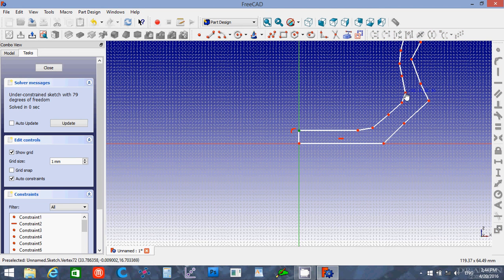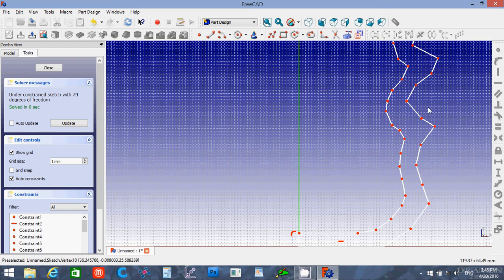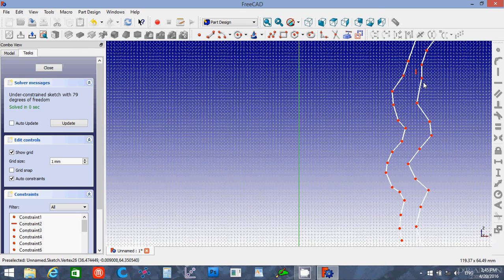Not all 3D printing filament is very good at actually keeping water inside. It depends on what type of filament you're using, what settings you have, and I would use the lowest print setting if I wanted it to contain water, because you want the layers to not leak, hopefully. If you really wanted to do this, you would probably use ABS and do vapor smoothing to it, because it would make it a lot more watertight than the 3D printing layers will.